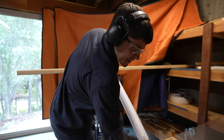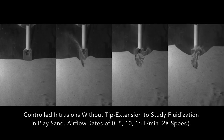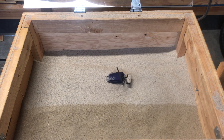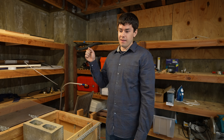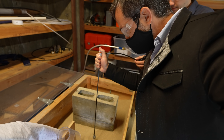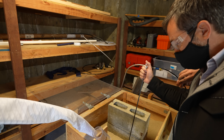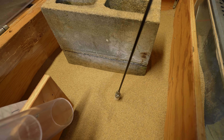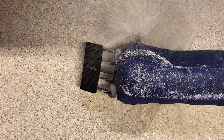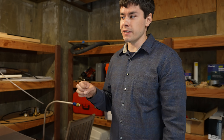There's another application: burrowing into sand or soil. When you blow compressed air into something like sand, it fluidizes — it becomes like a liquid — and that allows the vine robot to grow into granular materials. If you try to push a probe down into sand without fluidization, it gets wedged in. But turn on the air and you can feel it immediately. A jet of air blown out the front of the robot loosens up the sand enough to reduce the resistive force so that the robot, by tip extension alone, can make its way through.